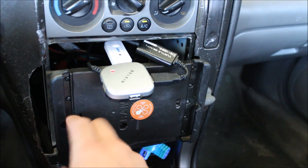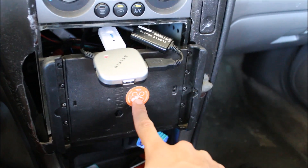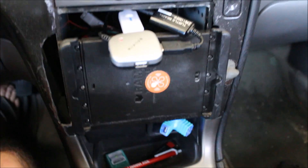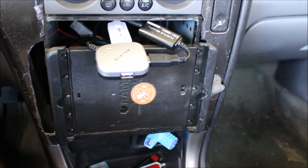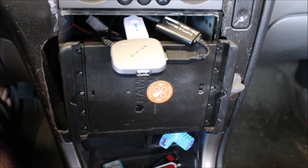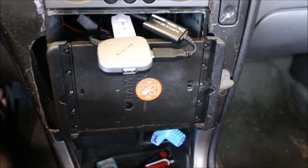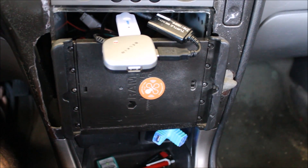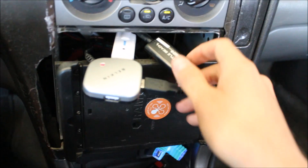The tablet sits right into this mount and plugs in. This NFC tag basically handles all the tasks I want the tablet to run in the car. You get the docking app called AutoMate, which is based off of Android Auto. It turns on Wi-Fi, Bluetooth, and GPS. So instead of having to sit in the car and mess with the tablet to get it ready to drive, that NFC tag takes care of it.